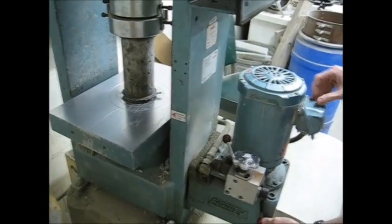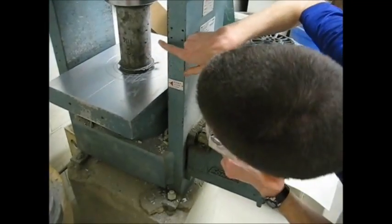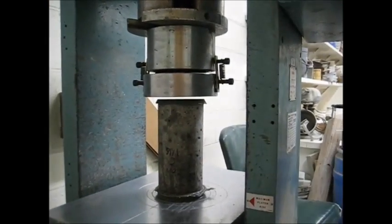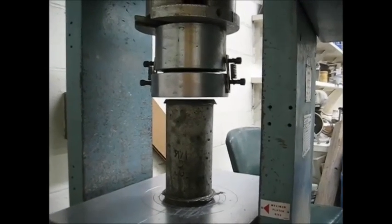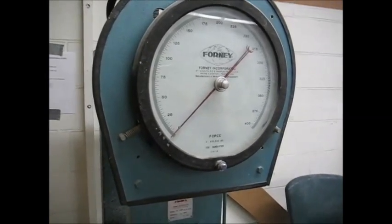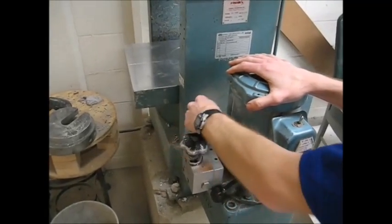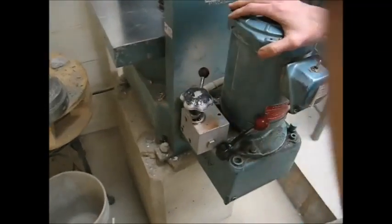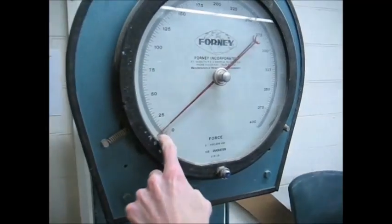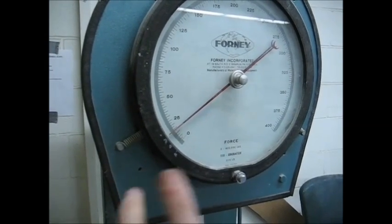Let's load. Turn it on. Engage the pump. Coarse adjustment — and that's as fast as it goes. You can visibly see it moving, so we call that fast. Watch the needle for movement. The needle's moving. Bring it all the way to the right and use the fine adjustment knob. You want to pass about one big tick mark every 10 seconds.